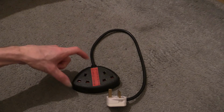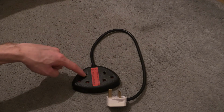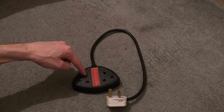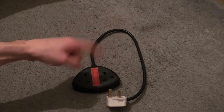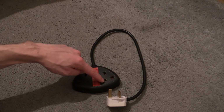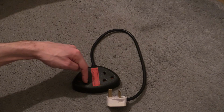But you can see in here the reason why I chose an older one and not one of the modern day rectangular ones, and that is because in here each socket has got terminal screws on it, and there's little linkages in between, like the neutrals and the lives. And what I've done is I've taken out the neutral and live ones and then put a bridging connection in just in there, sort of thing.